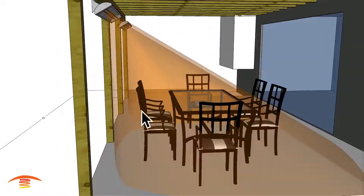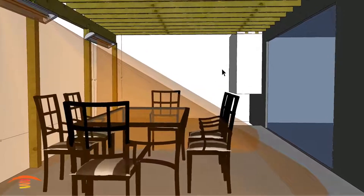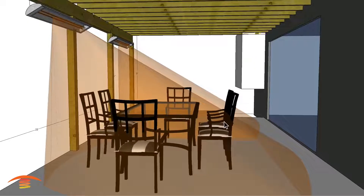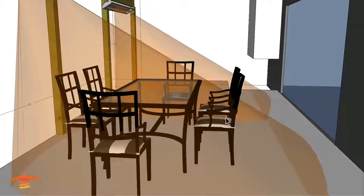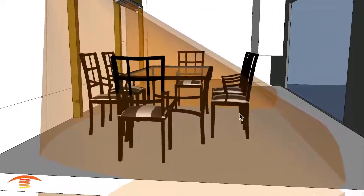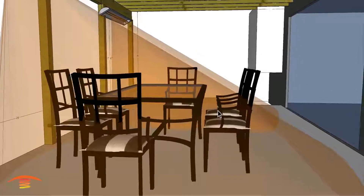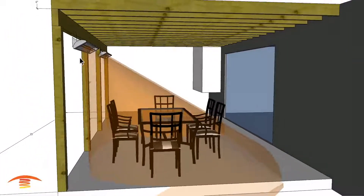If you were the person sitting over here, your upper body isn't really being penetrated by the ray of light. These are infrared light waves invisible to the human eye — the orange glow is just a reference for the footprint of heat. Your lower body is the only part that could even be reached, but the table is blocking that. So sitting over here, neither your lower nor upper body is being heated, because any object mass will absorb infrared heat. That's how your body stays warm as well.